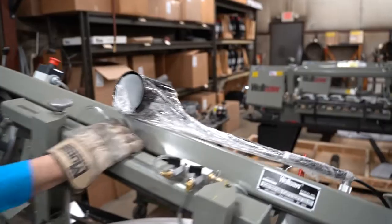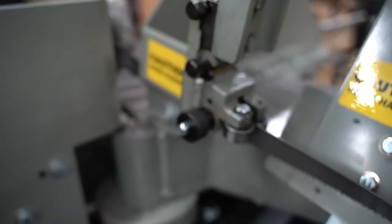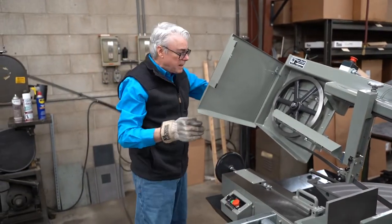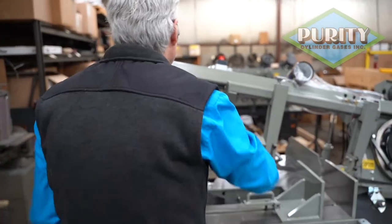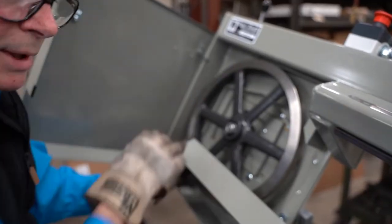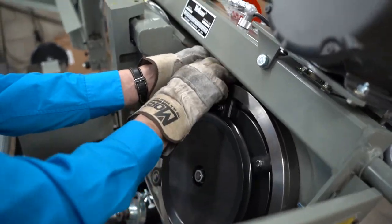Hold on to the wheel. Always easier with two people. Now you just twist the blade, push it up into the blade guides, like that, in between the rollers. Close the carbides — the spring-loaded carbides — and it's either all the way in or all the way out. There's no adjustment. It's sort of in the right place, so the next thing is to just slowly start to tighten the blade. What I'm looking for is to get the blade in the right position on the band wheels. I reach in and pull the blade so the back edge is up against the flange.